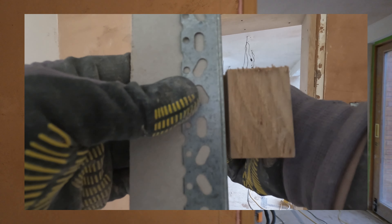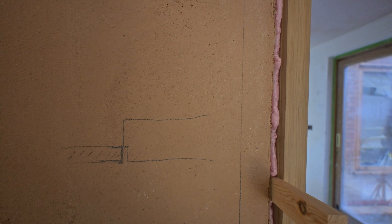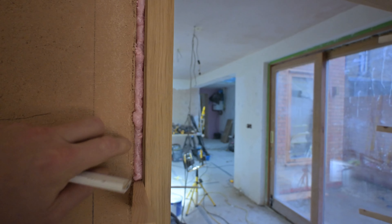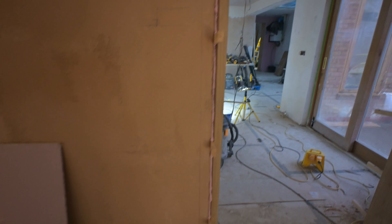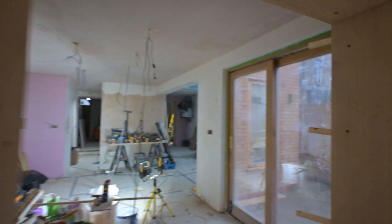This is my plan. If there is a builder on my channel or whoever's got experience with this kind of stuff, please do let me know if there is an easier way or a product that can just solve the issue of creating shadow gaps around doors. I know there's a trim for shadow gap on a skirting board, but it's also 12mm. I was even thinking to modify the product - get it cut and trimmed - but when I drew this all up and thought about all the possibilities, it was still better doing it the way I'm doing now in terms of time saving and the actual finish I'm going to get. Anyway, I'm just going to continue the way I've designed it originally and I'll show you how it all came out. Hopefully it'll be alright.